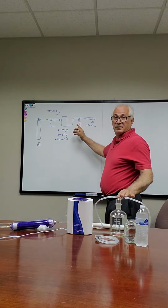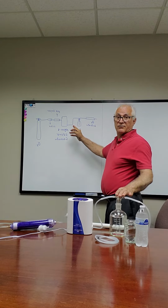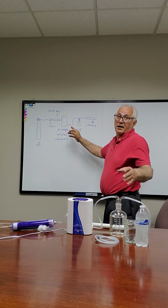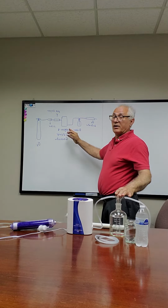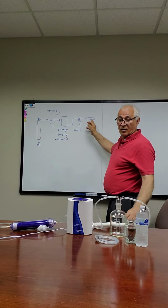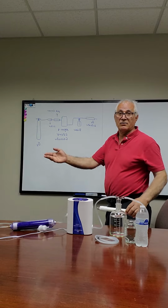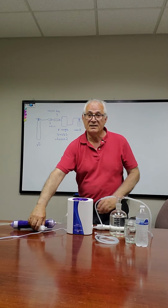And then the tank can be 1 liter, like a bubbler like this, or you can use the diffuser stone with other tubes for MP8, MP3, MP5, or MP1. And then pretty much go to the ozone destructor. Any ozone coming off the water, you destroy it before the oxygen is released to the air. That's pretty much the setup here.